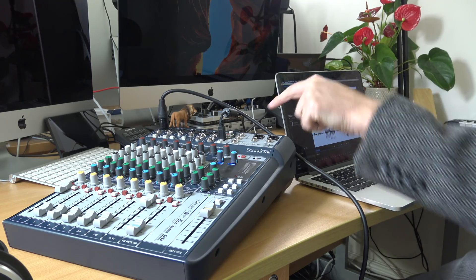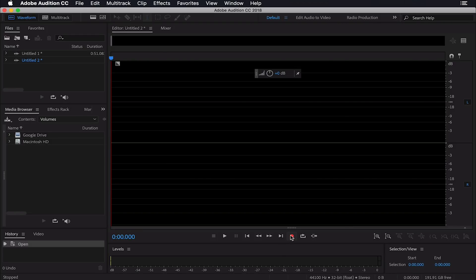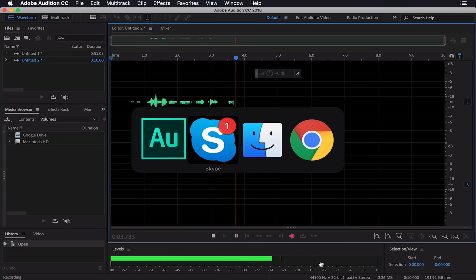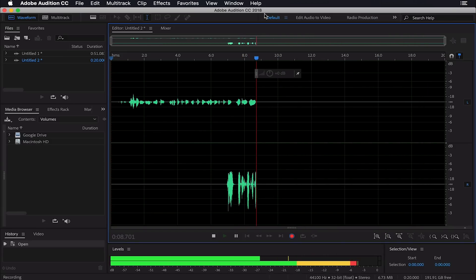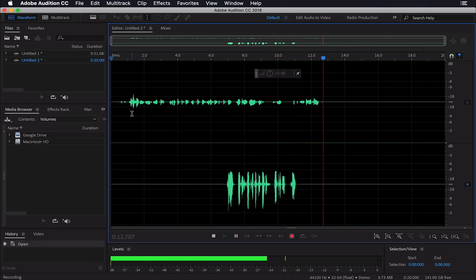The final thing you'll do is hit USB send — it'll change from master left and right to aux one and two. Aux one is on the left, aux two is on the right. If I start recording now into a separate Adobe Audition file, you will see I am coming out of the left channel. And if I go back to Skype and make a test call, you will see that the test call will come out of the right channel, which is really good.